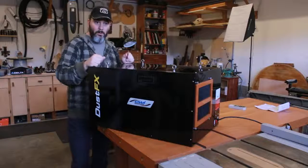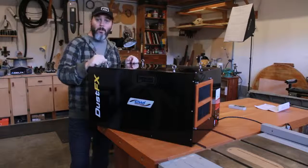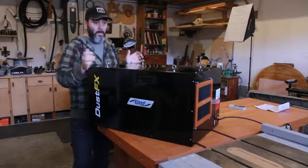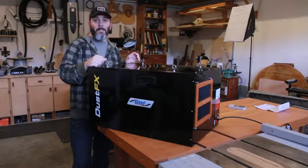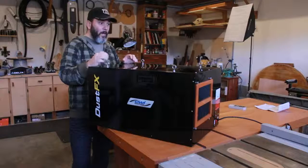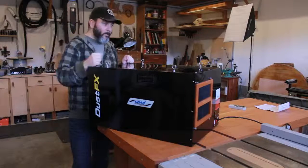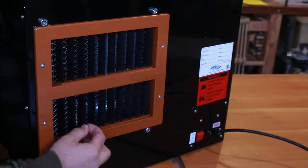I did a lot of research. You already know if you follow my channel that I like to support local — this is owned by a Canadian company, which was one of the big factors why I checked this unit first. Looking at all the other units, this one tops them all. Spec-wise, it has 1400 CFM and can clean a 20x20 shop about 16 times an hour. My shop is a bit bigger, so I'm assuming 14 to 15 times per hour. It's 63 decibels, so it's very quiet. It comes with little hooks to hang it from the ceiling, so I need to get some chains and anchors.